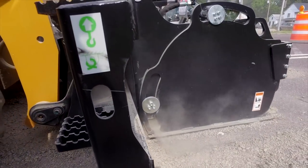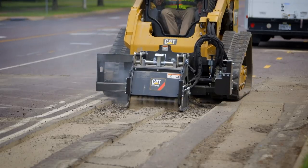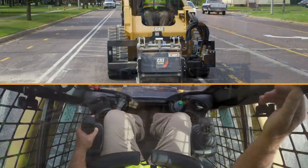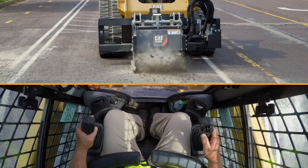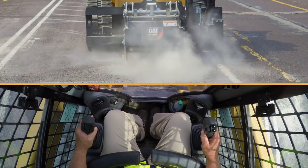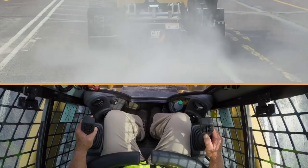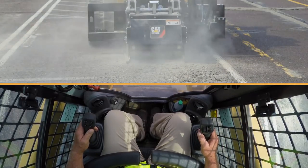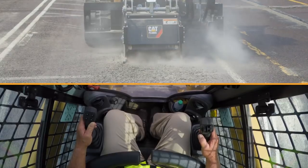Let's get started. Shoes are set at a two-inch cut. I have line of sight, creep control is on, and continuous flow is running. I need to idle the machine up. Slowly, I'm going to lower the tool until I have full contact with the shoes on the ground. I've set the creep control to number four, which allows me to go to the left joystick and run in full mode.